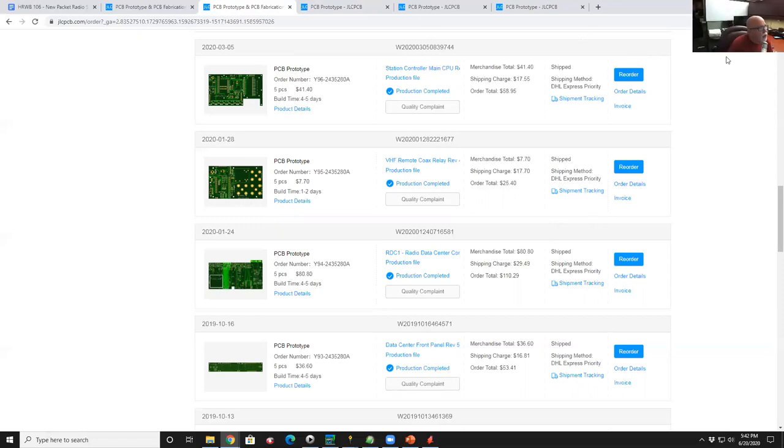So Steve's asking, if you've designed a small board, is it cheaper to order 10 of your board or duplicate the circuit and have them etch 5 at a time? That's a good question. If you duplicate the circuit, you're basically panelizing the design. Then you have to come up with a way to break the panel apart. And there's a few techniques for that.